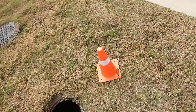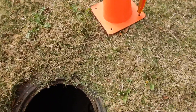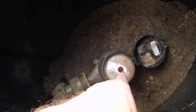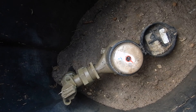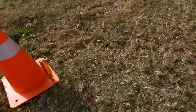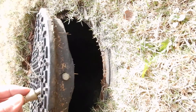This is the water meter test and water pressure test and some other basic plumbing things. Looking in here, this is the meter in the parkway, in front between the sidewalk and the curb. In the center is an analog meter — see that sprocket? That's called a flow indicator, some people call it a cheater wheel or cheater paddle. That's very sensitive; if water's moving into the house, that moves. So if it's moving, you've got a leak — at your lawn sprinkler system, a commode flapper, or somewhere you can't tell.